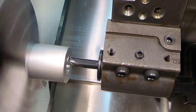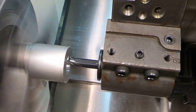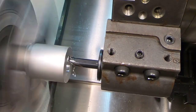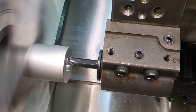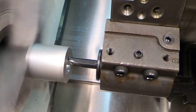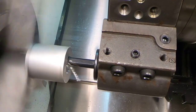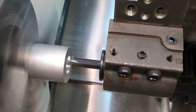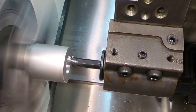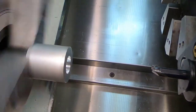So I'll come in and then come up. You can actually see that I'm cutting it. So I'll change to my Z axis and I'm actually going to make a pass on here so I can see a full cleanup. There we go — just enough to get that full cleanup. Notice I'm not going to move my part back and forth in X; I'm only going to move it back in Z so I can see exactly where I'm at.